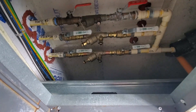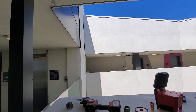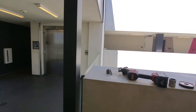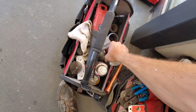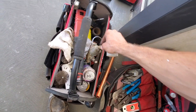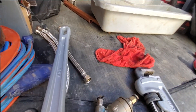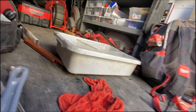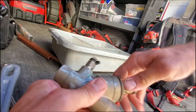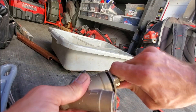I can't turn the water back on because I had to glue that CPVC over there and it needs a minimum six hours. But I've got one of the old K-valves I'll take back with me and open it up and show you. This is one of the K-valves I cut out — I meant to show you one of the new ones but I forgot. These are very hard to get off, but basically all these have is a cartridge nut...